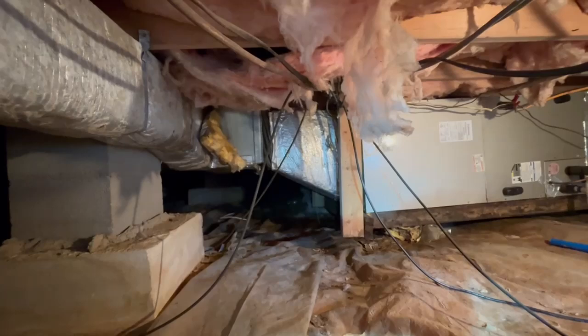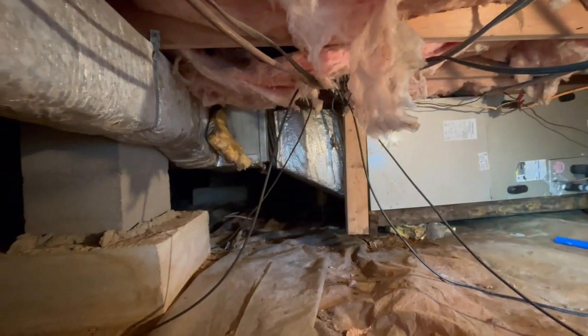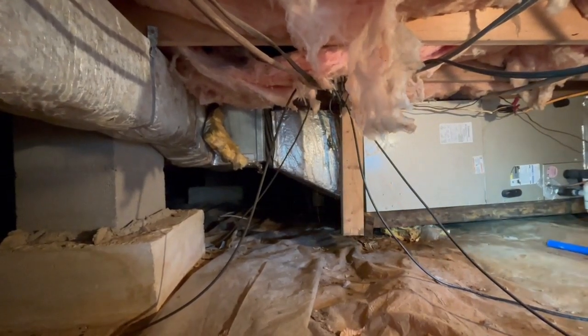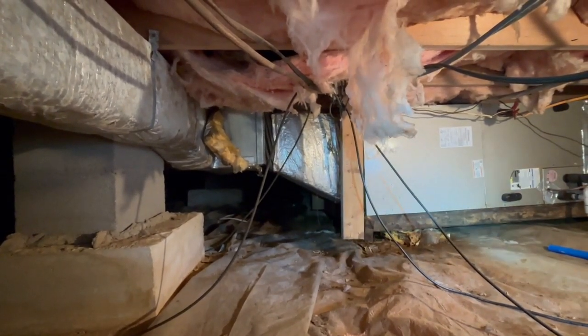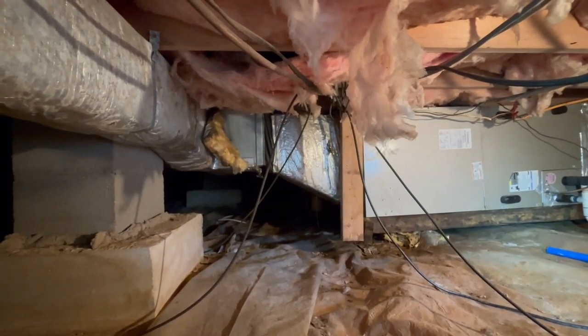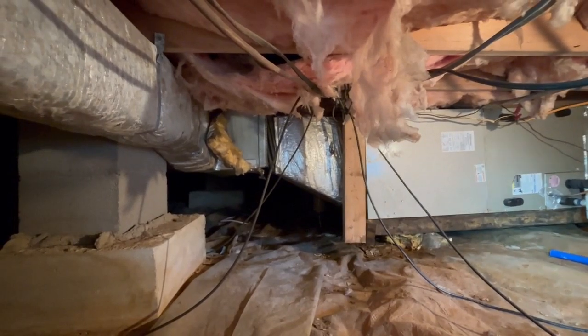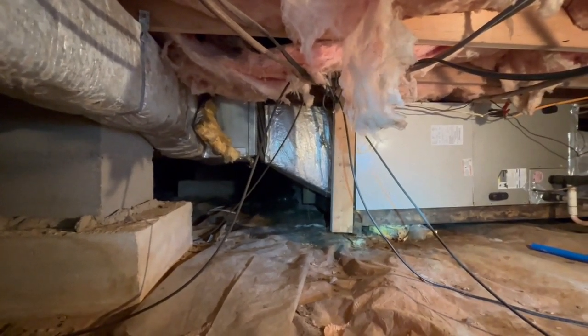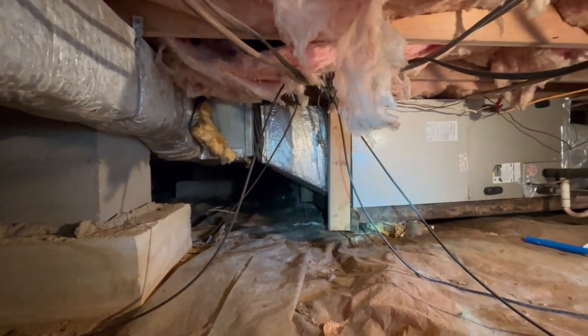So I'm going to put it on the pressure feed side. The disadvantage of the pressure feed side is that if you're putting the cold loop on for air conditioning, it's better to have the air conditioning on the return air end because you can then take the condensate out of the air handler far easier. But no big deal — it doesn't really matter.